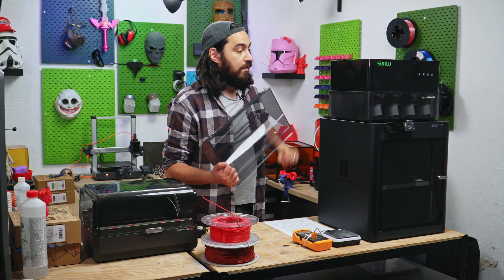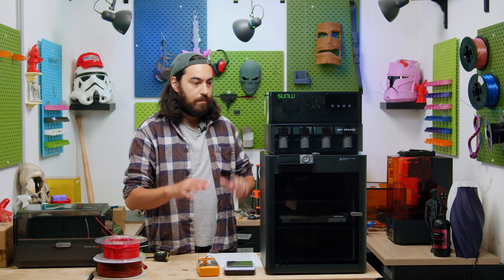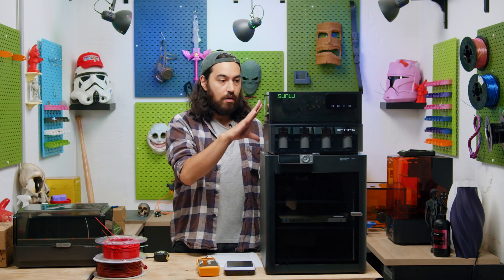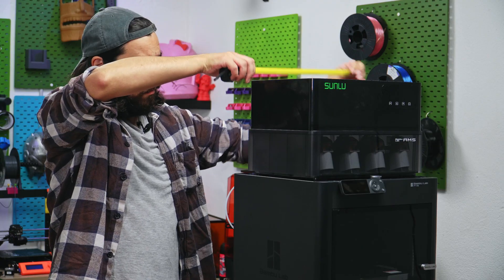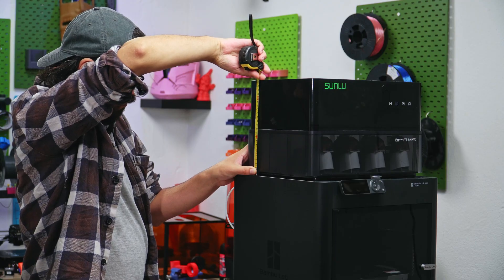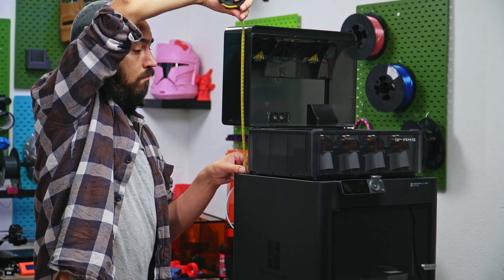Though then it might be difficult to actually change filament in the bottom unit. If you have your printer and AMS tucked into a small space, watch out — this is slightly taller than the original AMS with lid. The unit itself is about 130 millimeters tall. With the AMS, the combined total height is just under 250 millimeters when closed, and just under 400 millimeters when open. So if you have your setup crammed in somewhere, maybe measure first.